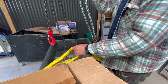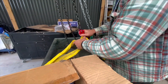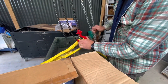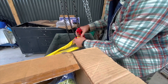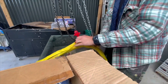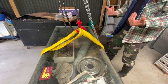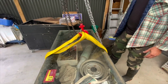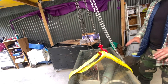Now this is where you do need to be careful. That yellow strap that goes around the tool chest is just one big circular piece of strapping, but it is rated to three tons. So you need to be very careful — it's not just some rope. I'm distributing the weight because each side has two pieces to it, so I can spread those out a little bit. I tried to get that in the middle as best I could to keep it balanced. Thankfully, those tool chests were reasonably well balanced as far as the loading goes — probably more by accident than good design, to be honest. By putting the strap in the middle, it did keep things fairly even.